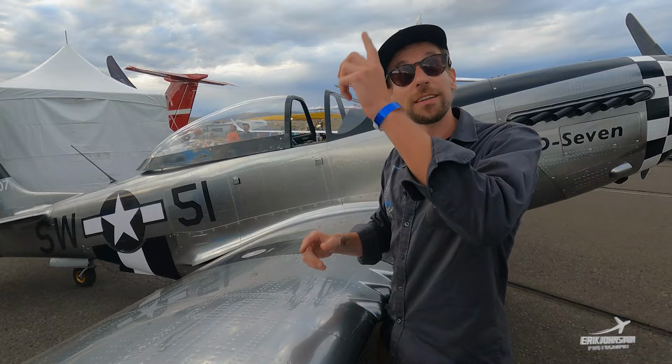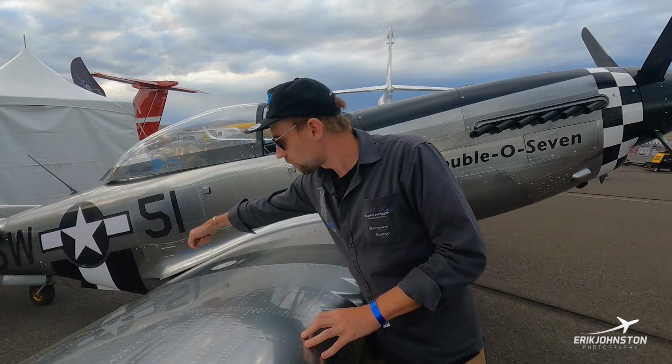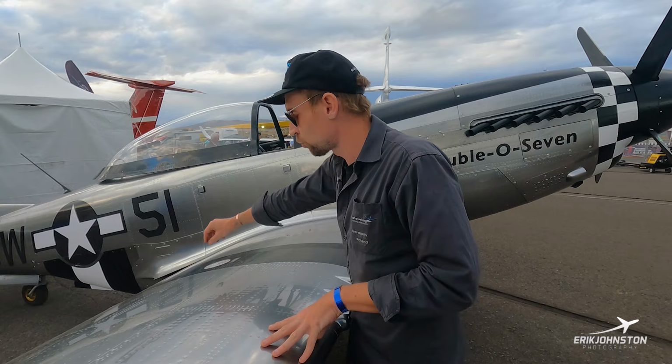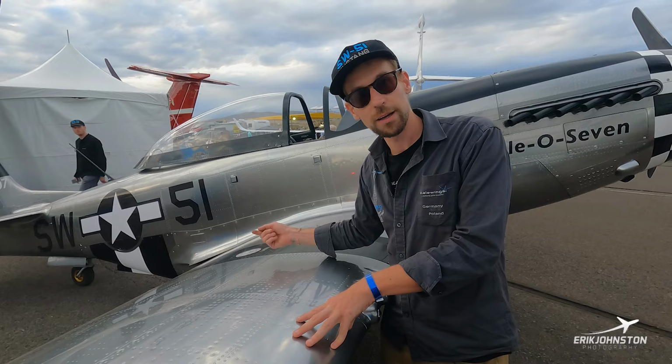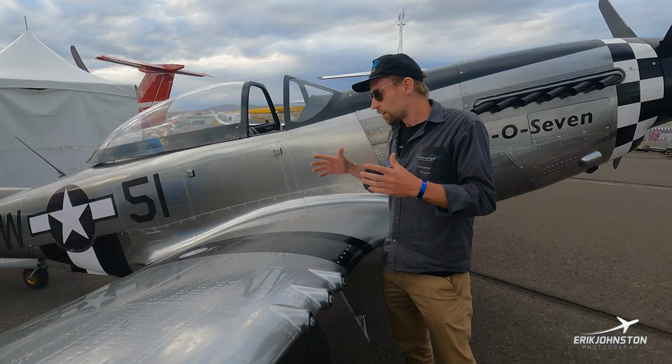And that just takes about 10 minutes. As we have two shear force bolts, one is sitting here, one is sitting there. We have a little tool, and then you can slide them back. Then it's mechanically already released. Then you can gently slide it a little bit out, and you just need to remove one screw for the aileron. You need to remove one screw for an autopilot if the autopilot option is installed. And you have some electrical connectors which you can disconnect, and then you can slide it off. It's a 10-minute job. The real fuel tank is sitting here in the center wing.